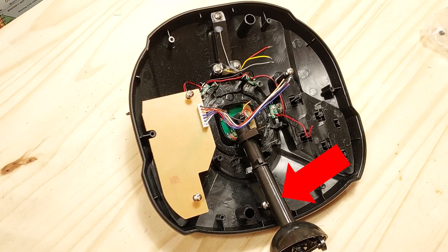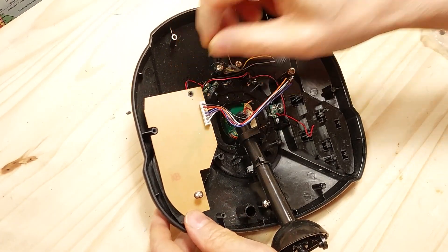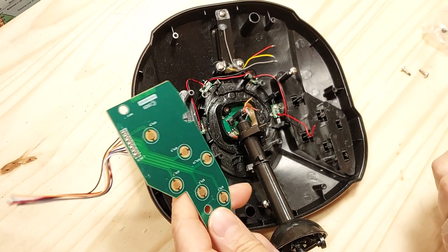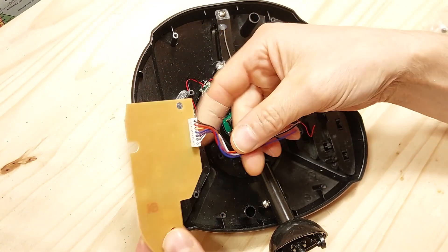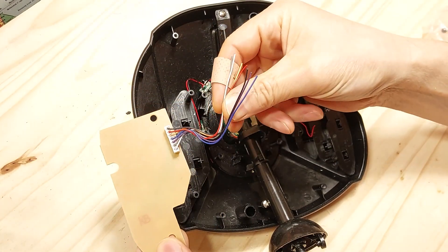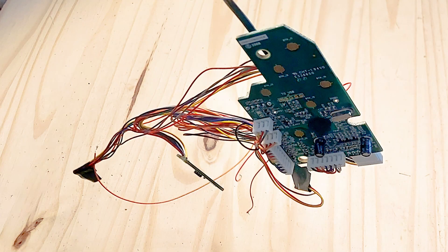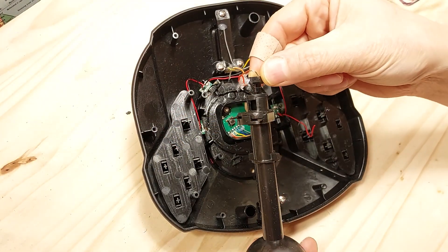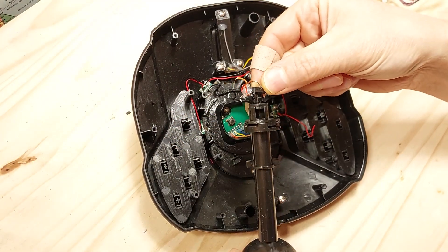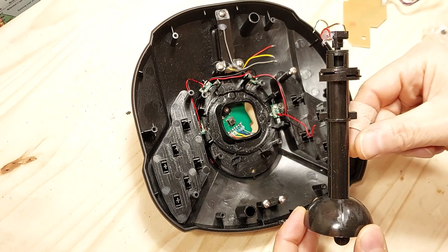What's left is the joystick handle and, among other things, a little button press board. We won't be using this in the collective, so just cut the wires a couple of inches from that board. It's a good idea to wrap tape around each set of wires that you cut to keep each function separate and identifiable. The joystick handle has a potentiometer sitting on the end of it — you'll want to cut those wires too, close to the potentiometer, and wrap tape around the other end of the wires that connect to the main circuit board.